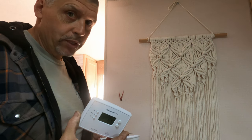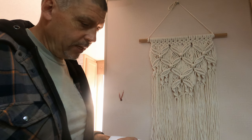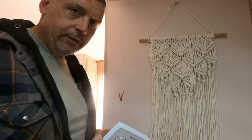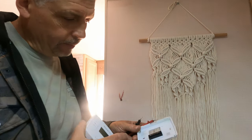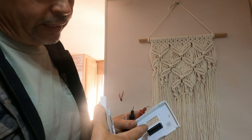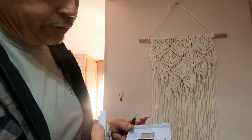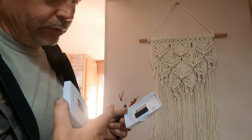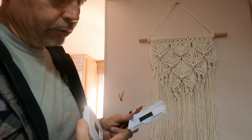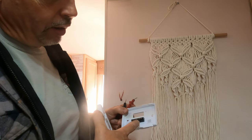There might be some misconception with thermostats because household thermostats like this are listed as 24-volt thermostats, but in an RV our furnace runs on 12 volts. Really it's just a DC thermostat — it opens and closes the contact, so it doesn't really matter; these work fine. We're only using two connectors. On a furnace you might have AC and fan controls and things like that, but here we're only dealing with on and off — it either closes the contacts or opens the contacts. The only ones we're using are R and W.